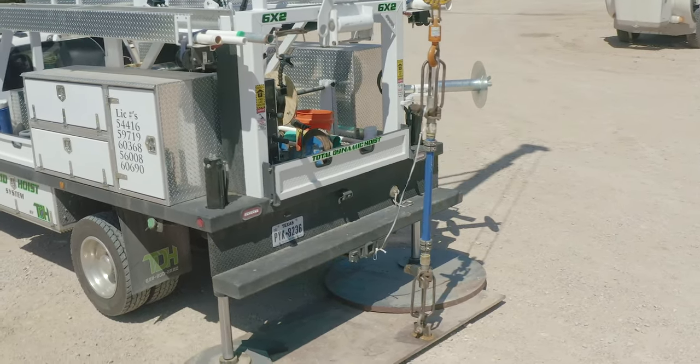One of the things I love about this setup is that the hose and wire stay together when we pull your pump. We reel them up on our big drum and they don't lay in the dirt — this helps us keep bacteria out of your well. And if you're one of those customers with a well we can't reach with our service truck, this hose is the only way to go. We can set up our service truck a good distance away from your well and run that hose through a series of pulleys tied to a tree or a post. We have a roller we can set up over your well head so we can set your pump. We no longer have to rent a crane to reach over your house to service your well. As you can see here, we're setting this pump under a windmill without having to lower the tower down. We will work with you and your situation to figure out a better way to service your submersible pump.